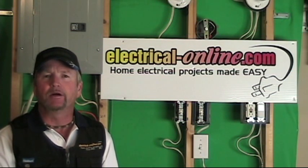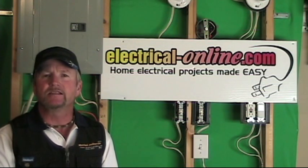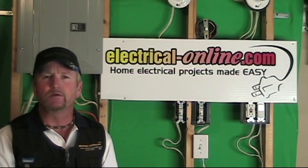I'm going to answer another question from one of our site visitors, and this one comes from Stephen. Stephen says, I'm going to be installing an outdoor lamp post alongside of a driveway. I have a new lamp post assembly which came with an 18-2 SJ cord pre-wired from its three lantern head down to the base of the pole assembly. The pole assembly will be mounted onto a 2-foot deep concrete footing with PVC conduit installed inside of the footing.